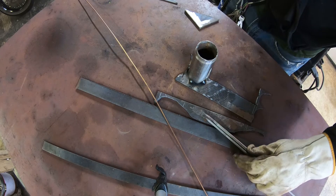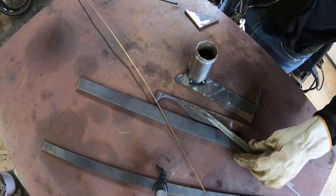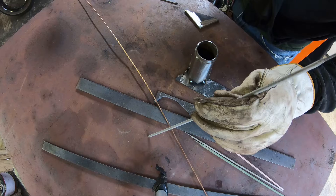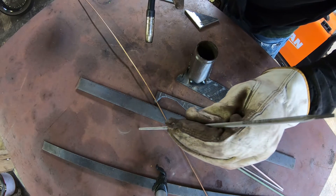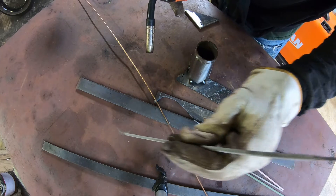If you start out with stick, you will probably become a better MIG welder. Not saying that you can't do it either way around, but with stick you've got a little bit more control going on. You've got to strike and start your arc without sticking, and then you've got to maintain a certain feed rate as you burn the rod up. As you burn it, you're going to have to keep moving it in as it burns up, as you're melting it into the base material.